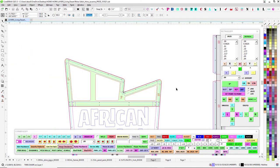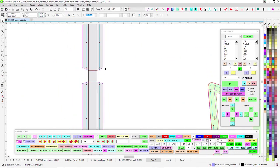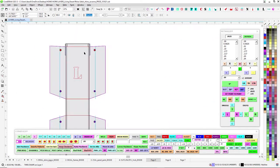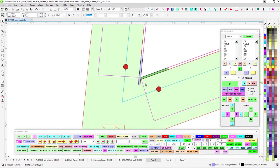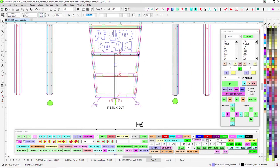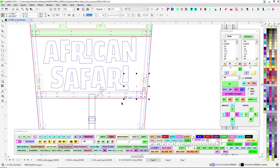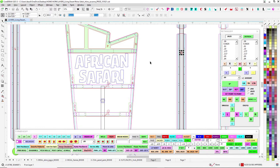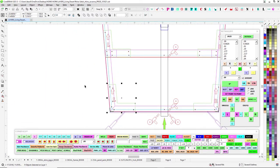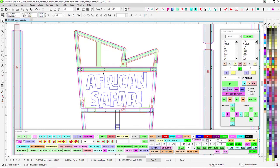This whole right side and the whole left side is in one piece - we haven't done it like this before so I'm interested to see how it works out. You have a little bit there where you can get your gun in and tack that together where it overlaps. Put your gun in there and bring that seam together. These are not symmetrical - the angle of the left side is a little different than the right. So all of your right side jigs and anything with an R on it needs to stay on the right, based on looking at it from the front. Make sure all these jigs are on the proper side - they're all marked properly.